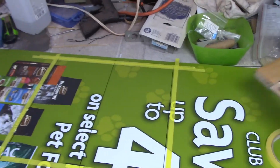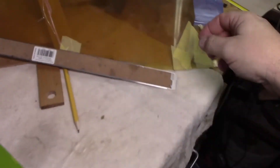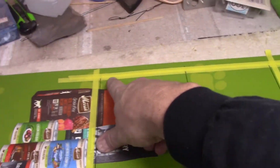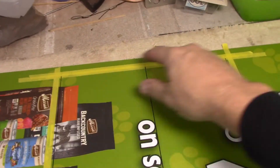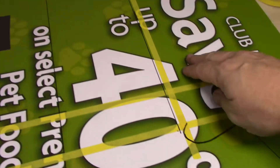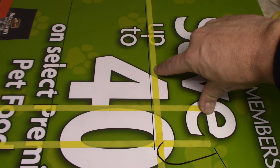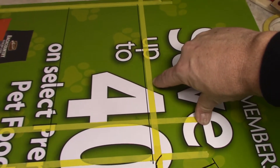What I had to do — I had to flip it over. The side I started on, I didn't put it high enough up; the whole front end was going to hang over, so I had to split the difference. Instead of this being at 60 millimeters off, it ended up being at 25, just to shift it that way. I've got a straight line that I can indicate off of. So this is all set up now and I'm going to cut on the outside of this here.